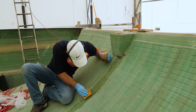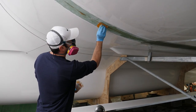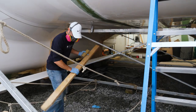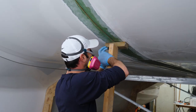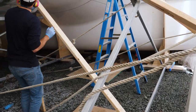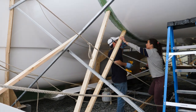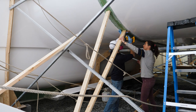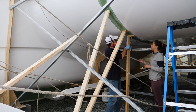The surfaces aren't completely even right now because we need the gap there to get the filler in. Once it's in on both sides, we'll get braces and move things so it dries level. Bonding together the upward sloping portion of the bridge deck was going to be more difficult than the previous section, since the outward forces of the hull pulling on each section made proper alignment harder. Matt had found that using 2x4s wedged between the ground and the hull could achieve the plumb seam we were looking for. With our thickened vinyl ester applied, it would leave us with the smooth, even seam we wanted.